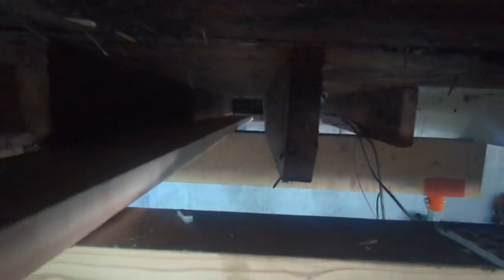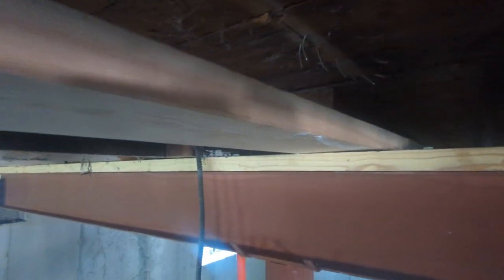and I can't turn my flash on, I figured out. Anyway, you can see all these nails coming down from the subfloor boards that used to be coming through into the joist. They just stop right there, so I'm going to quickly buzz those off with the Sawzall, and then we'll roll this guy. He's sitting on the new beam and on my temporary beam over there. We're going to roll him up. I can't do it here because I haven't got room to roll him up like that. Smash him into place. It won't hurt that these aren't nailed into it.